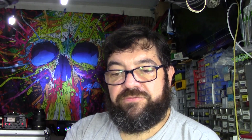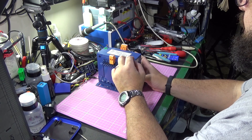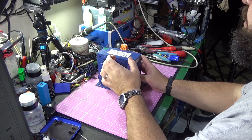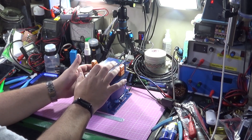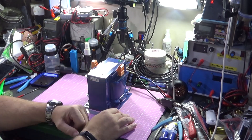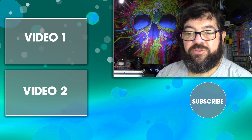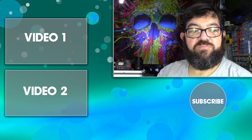It's ideal for isolation purposes, which is what they're sold as. The company that makes these — I've bought from them before and I've got some smaller versions: a 100 VA and a 200 VA transformer, which would be okay, but I wanted to get something a little bit beefy so that I could test larger things. So this is 1000 VA or 1kVA, and as you can see it's just a big heavy lump of iron. As time goes on I will do a video of the build, but I thought you might like to see the transformer as it is before it actually goes in the box.